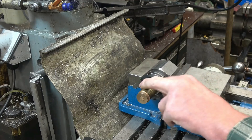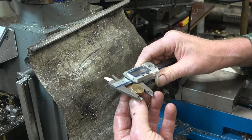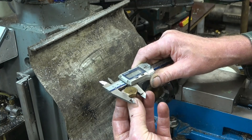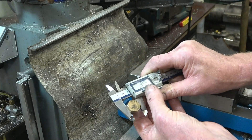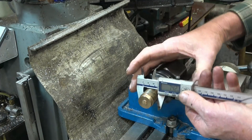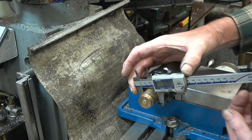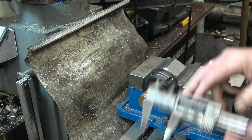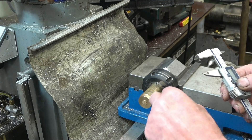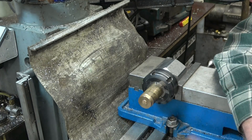Find a suitable cutter, do a little bit of maths, and then we can get it machined. If we simply measure across the flats on here — 18.9mm, about three quarters. Then we measure the diameter of the piece of round stock we've got, which gives us 26mm. So if we take 3.5mm off each side that should bring it down to 19mm. I think I'll do it off the side and I can do it in one cut.